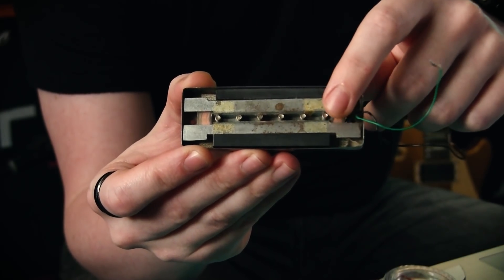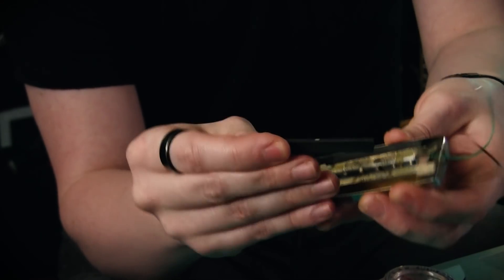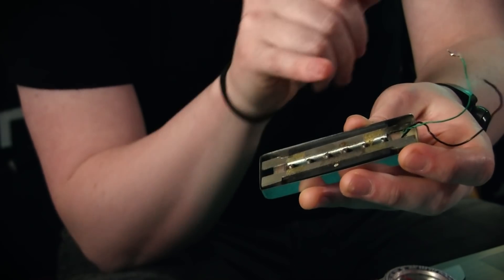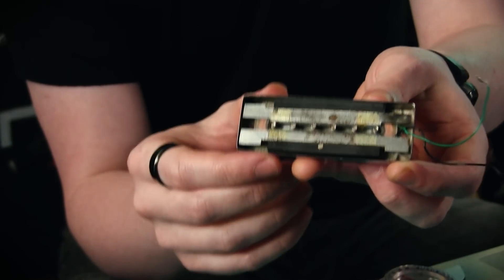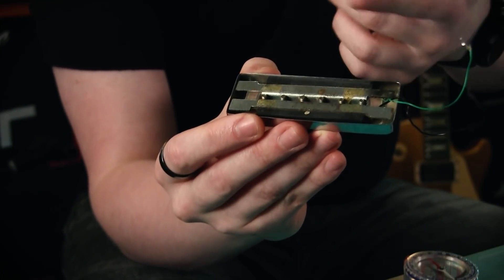Let's confirm that theory. On the back steel core there is some tape residue on either side, so there's obviously been a piece of tape across here at some point to hold the magnets in, which has since perished. If I pull this magnet out and give it a little turn, we can see this side of the magnet not only has a little white dot on it, which may indicate it's the right side up, but we also see the same adhesive residue that lines up perfectly with the tape residue on the steel core. So I would guess this is now the correct orientation, and we'd need to find the same for the second magnet and check it with a compass.